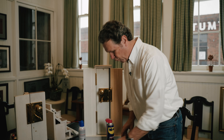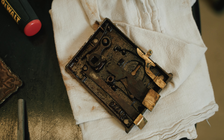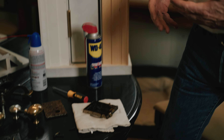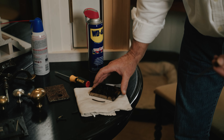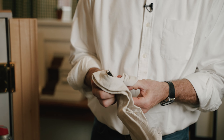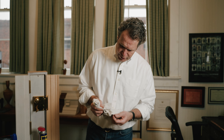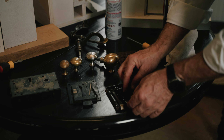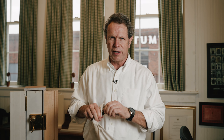Someone pointed out that WD-40 is not really a grease, it's not really an oil - it's a property that helps with rust. So I'm actually going to use this now, but then when I close it up and go to take care of it, I'm going to let it sit on there so that it beats down that rust. But once that WD-40 dries, I'm actually going to put some 3-in-1 oil or something a little bit heavier on these things to grease them up and get them going again. There's nothing stopping me from taking this whole thing apart. Now that I've sprayed it, I can take each individual part and just start cleaning it - take my rag, might even take a little steel wool to make sure the rust is off. There's nothing wrong with this lock. It's got a little patina on it, but this will go right back in place and move in and out. I'm going to take each one of these things out and clean it up. There's nothing that's going to keep this from functioning for another 50 years before you have to clean it up again.